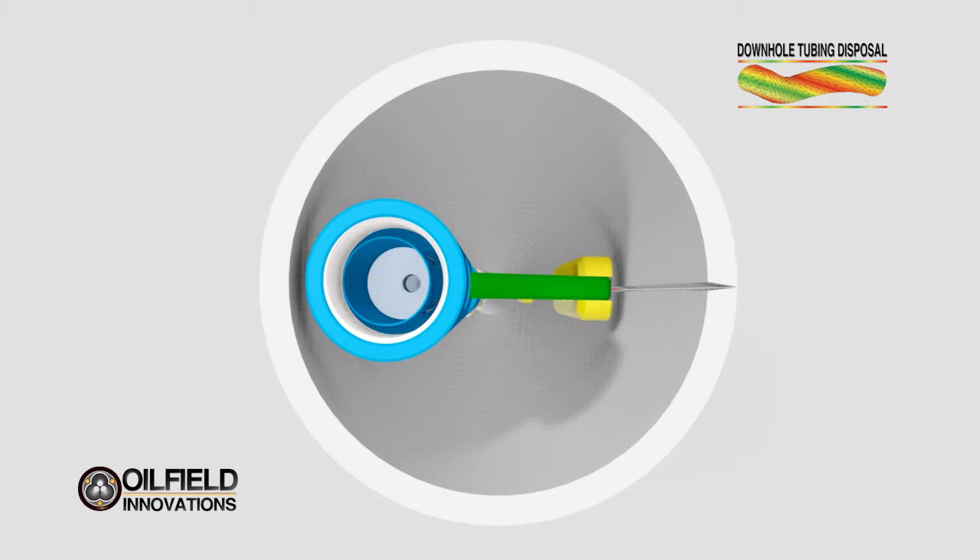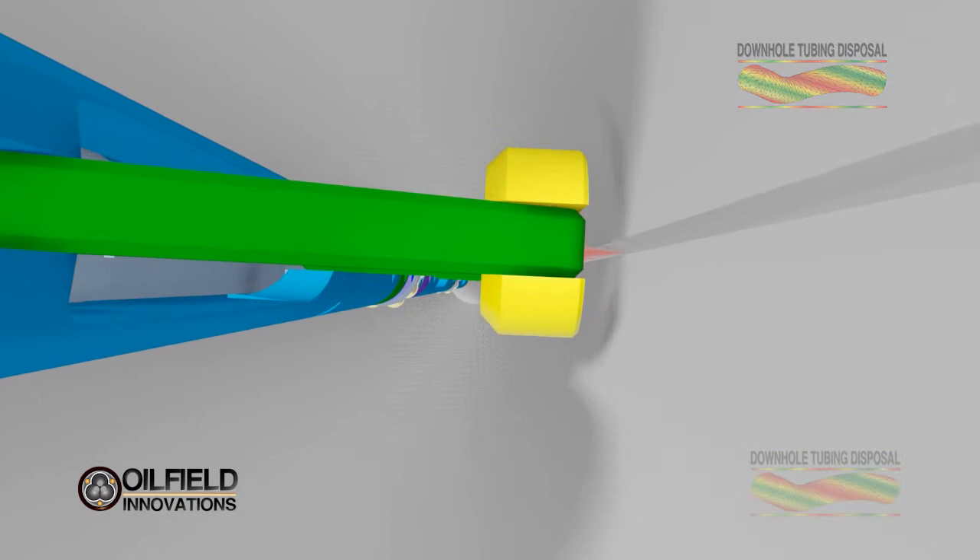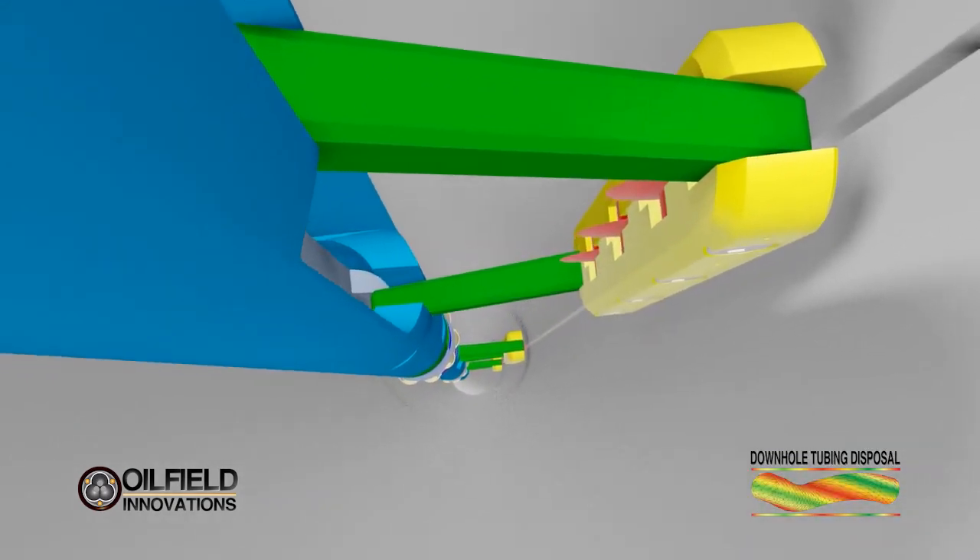This is an illustrative look, as gravity would pull the heavier housing to the bottom of the tubing with the vertical skate pointed directly upwards. The design is purposely made this way so that you can make multiple runs and always locate to the upper side of the tubing and re-enter or stay within any previous cut tracks. Once a cut groove is started, the plumber's cutting wheels will stay within the groove as the tool string is lifted up and down, progressively cutting ever deeper into the wall of the tubular.